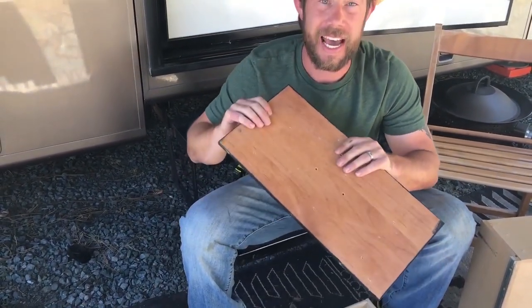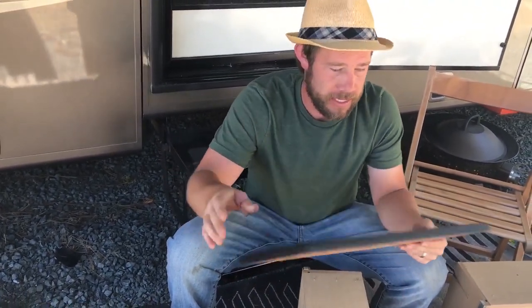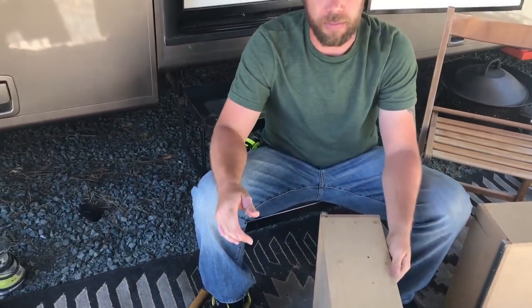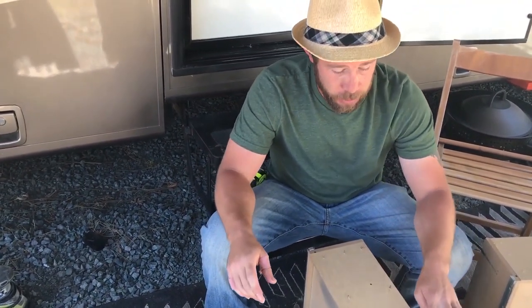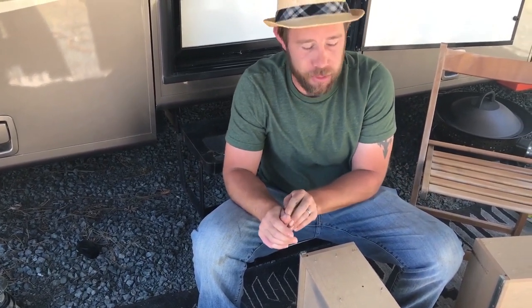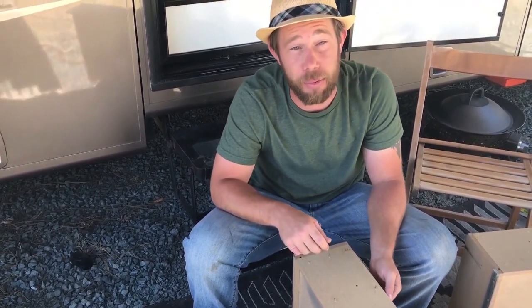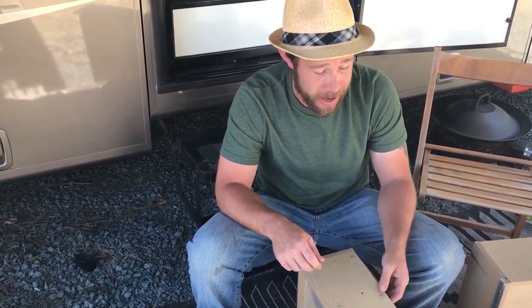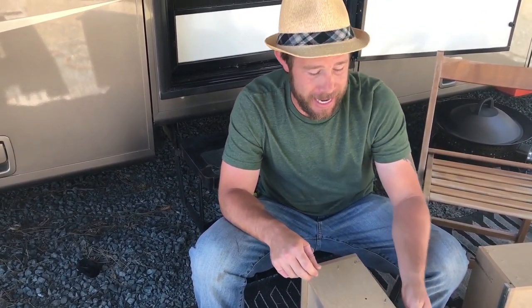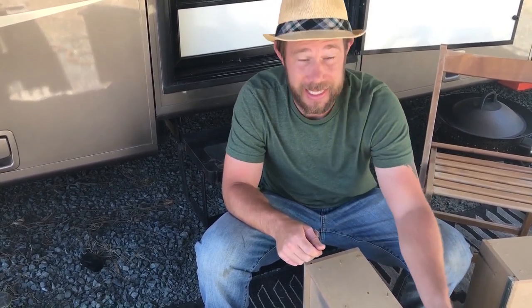So just like that, the drawer front is removed, and we've already got our pieces cut down, or we're gonna cut our pieces down here in a second, but first we need to remove these staples. Now, in the past, I've tried to actually hold them steady and hammer them back through and pull the staple out entirely, but that can be a real pain, and with all the repeated pounding of the hammer trying to nail it out, it can loosen up these bonds on the sides.